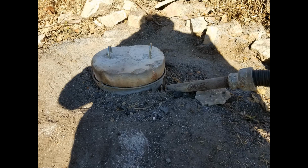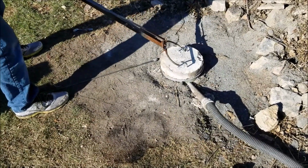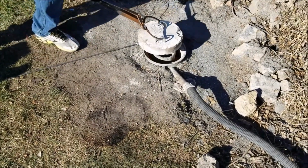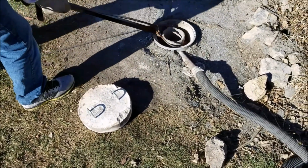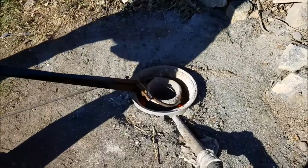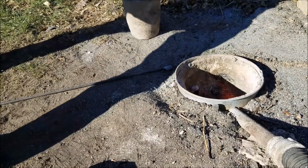Here is my blast furnace. I used a 10-gallon steel bucket as the base for the furnace. The steel bucket is lined with about an inch of a homemade refractory material, a mixture of play sand and plaster of Paris in a 1:1 ratio, and then mixed with water. The lid is made of the same material, but with a dense web of steel wool for structural support.